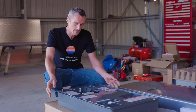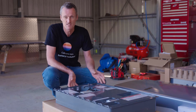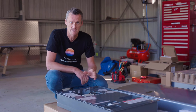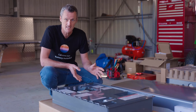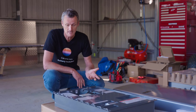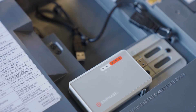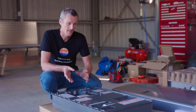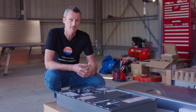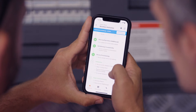All of the energy and connections of the installation land at the IQ system controller, so this is really the hub — or the heart — of the battery system. It incorporates switches and safety equipment to ensure that the system continues to operate safely and make decisions on how to supply energy from the batteries into the home. Every system controller comes with a cellular modem, enabling a backup internet connection so that the installer and system owner can constantly view and monitor the system through their apps.